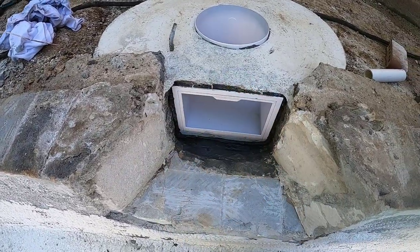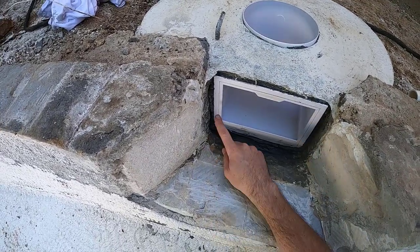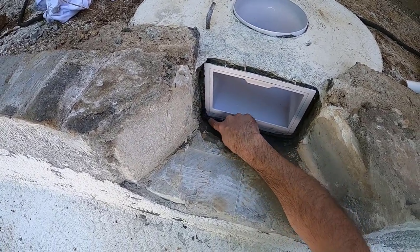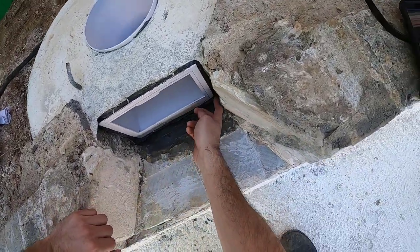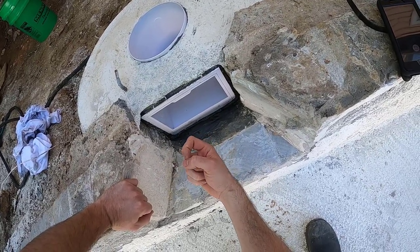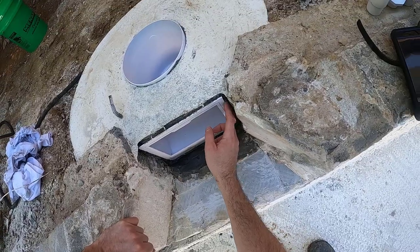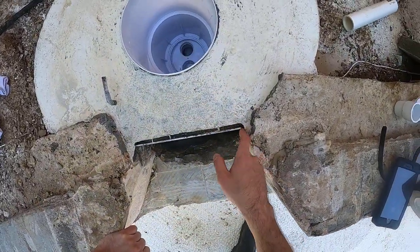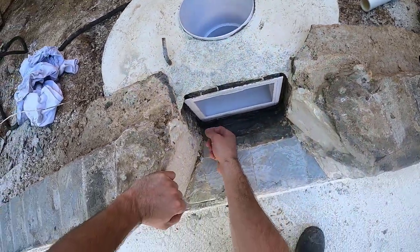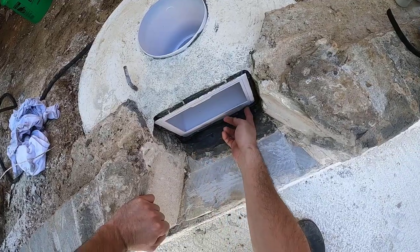Once the skimmer was installed, poured in concrete, and set up, there are two steps I'm doing to finish off the face. First, I used a masonry urethane and pumped a bead and smashed it in around the channel that was left after I poured the skimmer. Because if you remember, I took some half-inch or one-inch foam, slid it, and made a foam wrap around the face of the skimmer — that left a nice little channel around the backside of the skimmer. If we look down from the top you can kind of see where that urethane is, so that was the channel that the foam left for us.